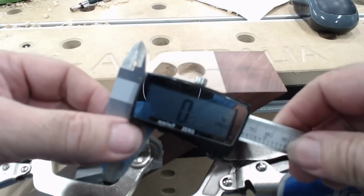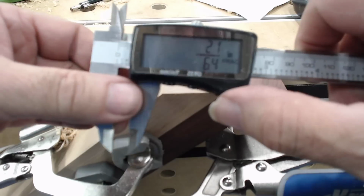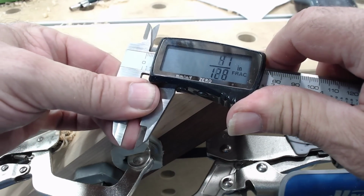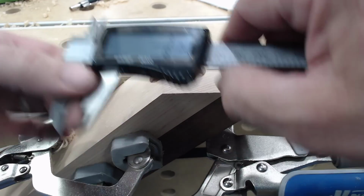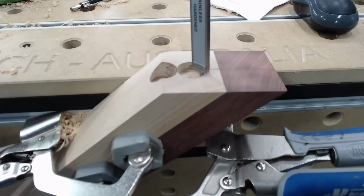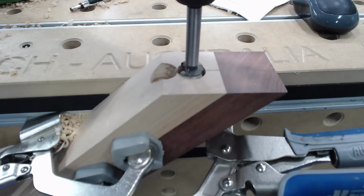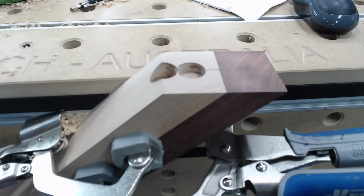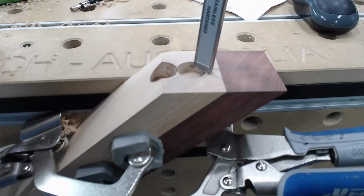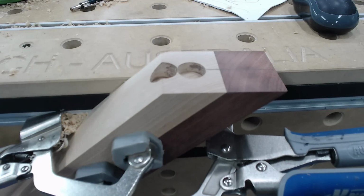We're back to 0 inches. Slide him down. 21/64. And if I was someone that could understand all that language to those accuracies, well then I'd be living in America. So it's got to go down another 1.5 millimeters as far as I'm concerned. Here we go. That'll do me. Let's have a look. Good. That's going to do it. Back that out again so it doesn't go flat.